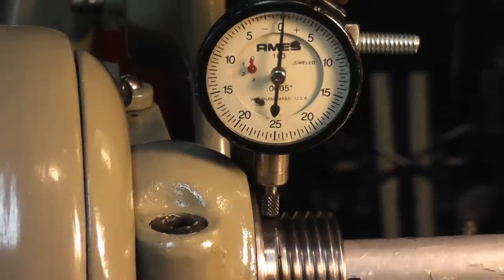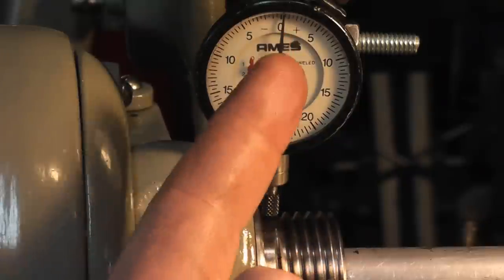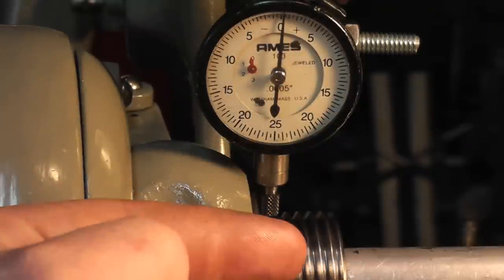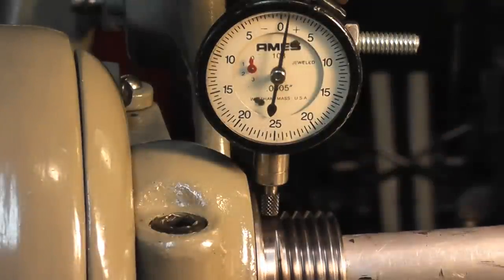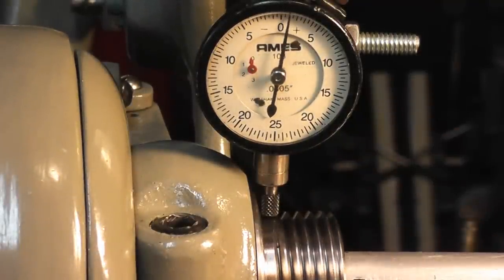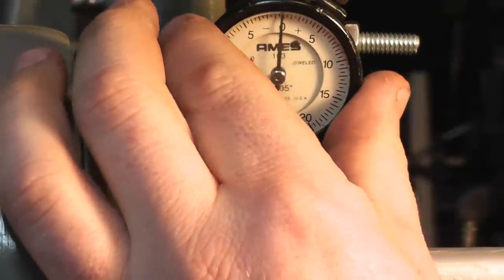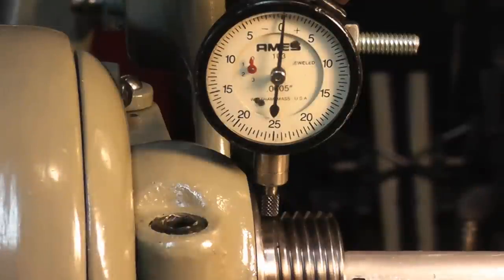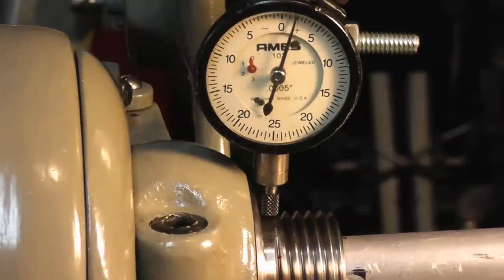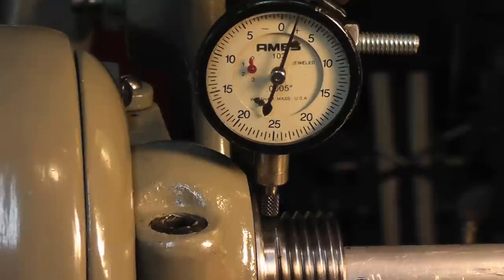And you'll see the deflection in your indicator as the entire spindle actually does this. So, double check. What I always do, push it back down again, because now, see, I had a little bit of a difference there. So re-zero the indicator, because now it's settled, and pull dead nuts up. There we go. I got about 2/1000ths of clearance on that.